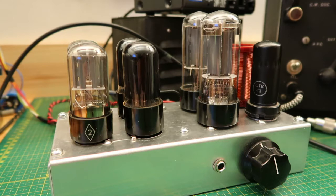Of course there's some carrier leakage, which is to be expected from a simple circuit like this. However, this could be improved by installing a potentiometer in the grid leaks to tune the amplitude. You could also add a split stator capacitor on the control grids to be able to tune the phase. Even though I don't have any of that on this transmitter, it's still performing quite well.